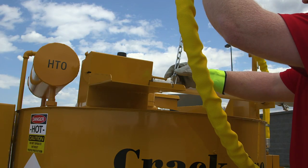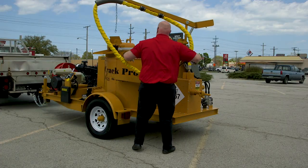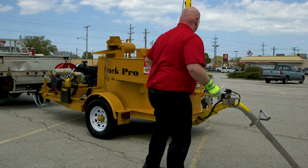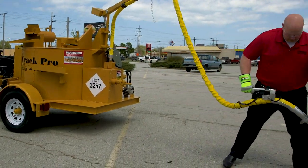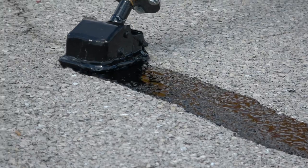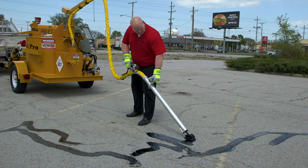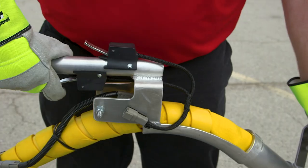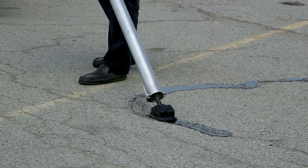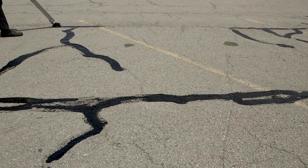Now we're ready to start applying. He's released the counterbalance hose boom and brought the wand out — notice that he did not twist the hose. Depressing the switch on the wand will pump material down to the applicator shoe, and you will notice how easily it glides along the surface. He has released the switch to stop the flow of material, then judges how much material is in the applicator head and pushes the switch again to start the pump back up.